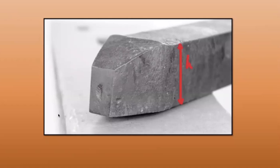What I want to do first is I'm going to make a blunt taper to the end. And you can see here that I've just got this one-to-one to the height. So whatever is your stock, in this case, 1.5, I want that taper to the end to be about 1.5, the same as the bar is thick. The nose, I want to be about 2/3 of the height. So if it's 1.5 bar stock, that nose is going to be about an inch. And, you know, heavy on the about. Don't be there with a rule trying to measure these things. If it looks right, it is right. And then the width is going to be 1/3 height, or it's going to be 1/2 inch. I would probably pad that a little bit, take it out to 9/16, not quite 5/8. 5/8, you've got too much left in reserve, and you're going to get a surprise later on.